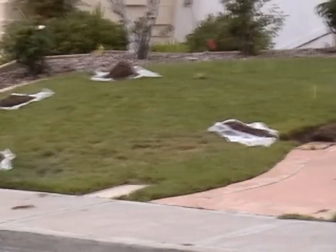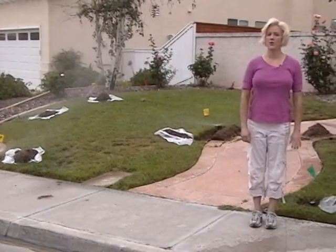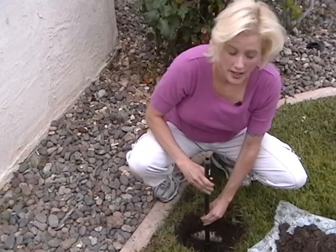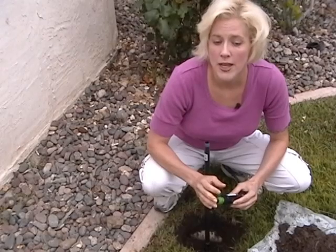Set your irrigation controller to manually run the station for about three minutes. This will give you enough time to make sure all of your A zone heads are on and all of your B zone heads are off. If most heads are doing what they should and one or two are wrong, you probably had a valve preset incorrectly. Turn the system off and wait one minute for the valves to reset. After you've waited a minute, you can reset the head that was wrong. Have a long adapter ready to keep the water from draining into your hole, then unscrew the SpraySmart valve from the adapter and quickly install the long adapter. Push the plunger once firmly until it stops and reinstall the head. With SpraySmart valves, timing is very important — never run the station for less than a minute and never restart the station without waiting at least a minute, as a quick restart may cause the valves to get out of sequence.